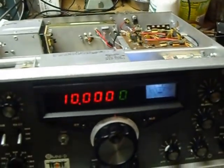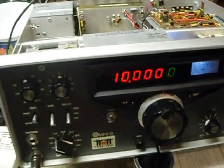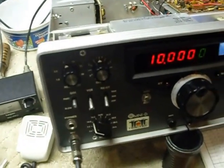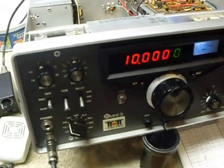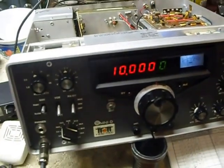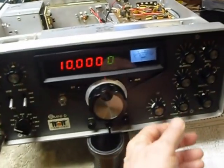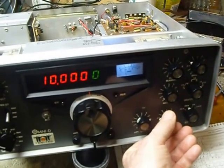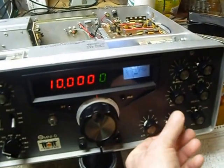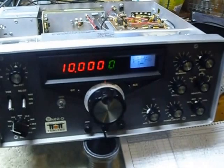So I just wanted to show you folks what I had done to stabilize this VFO or PTO. And of course I had lubricated it using 10W-30 synthetic oil. I like that synthetic oil because I don't think it'll break down over time like a regular organic oil does — only time will tell. She's right on frequency on WWV there. With that I'll say 73s everyone and good DX.